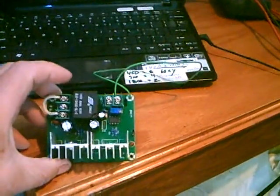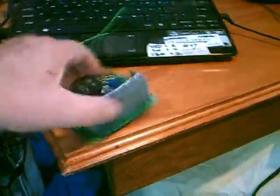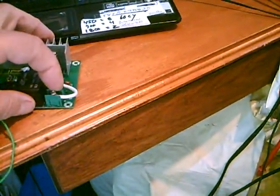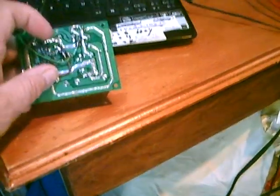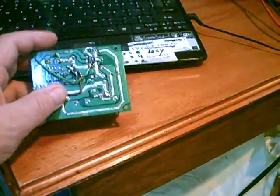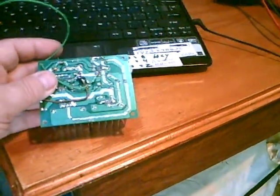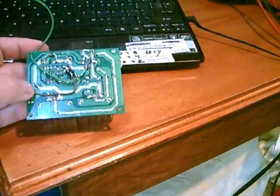This is the board, and there are a couple of modifications you have to make. There's a diode between here — you take that out and put the diode here, and take out the resistor. There's a trace you cut. Here's the 13-volt center; you feed power in from this center pin. These are the two output pins that go to the water heater element, and I feed those through a 100-ohm resistor for some protection. Here's your opto-isolator. This is the pull-up resistor for the TL431. This green wire I have shorted out just for test — it goes to the TL431, which is the inhibit line. When this goes to ground, the control board works at full bore; when it opens up, it shuts off.